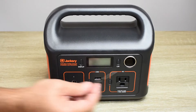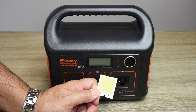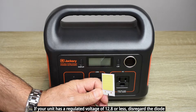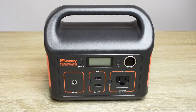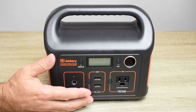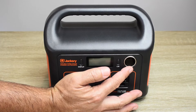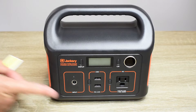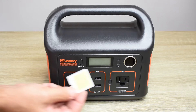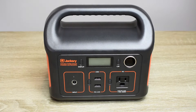The purpose of this diode is to lower the input voltage to this mini panel. I want to keep the voltage around 12.5 volts, and by doing that it's going to prevent it from getting too hot — you'll have great light output and will not require a heat sink. This Jackery unit has a regulated output of around 13.3 volts; the Max Oak is right around 13 volts. Some units do not have a regulated output — as the battery drains towards 9.6 or 9.8 volts, this COB LED light will get dimmer and dimmer. But with this unit, it will remain bright all the way down.